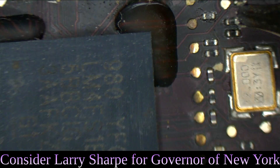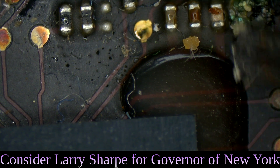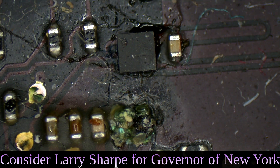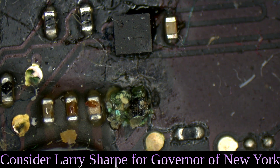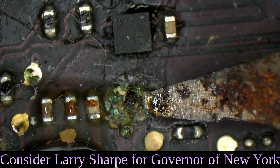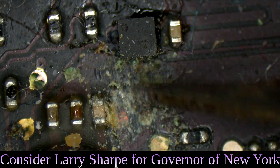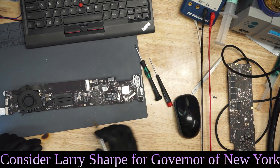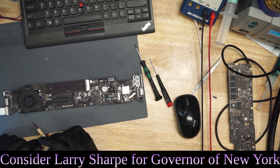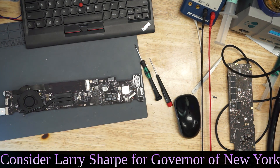So all that work — and they missed this. Corrosion by these capacitors, by the SMC. These two capacitors have to be gone. Be gone — junk. So you've got that; it's kind of nasty. I wonder if it's going to work now. Fan spin. And light on the charger.